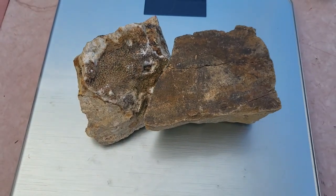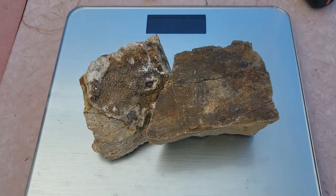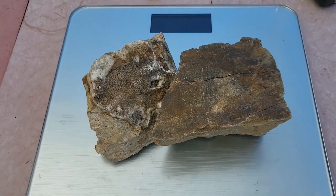So we're going to take just these two rocks, we'll hit them in the K&M crusher and put the tailings into a bucket. We're not going to sluice them down or anything like that — we're going to full-out smelt this. We'll start in a crucible, cupel it, and see how much silver per ton we get. Let's start by weighing the rocks — 3.4 pounds. In these two little rocks, that's just 3.4 pounds of ore.